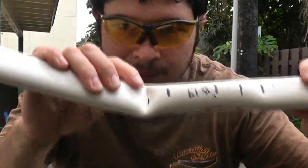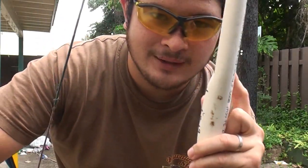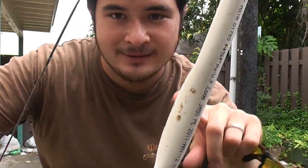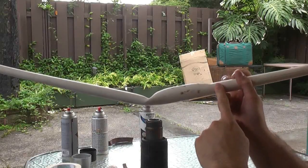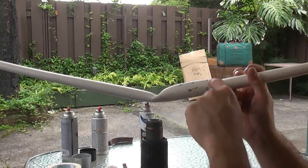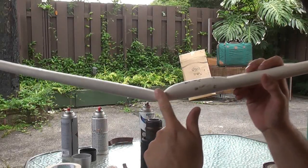This is not the end of the bow. I'm going to show you how to fix this and then show you what to do to this side — this is what you'll do to every bow that comes right off the flattening jig to prevent any kind of collapses like this. In technical bow terms, this area is called the fades or fade-outs, where the handle transitions into the limb. You want this to be a nice smooth transition, otherwise what just happened here will happen.